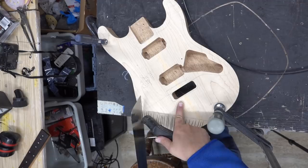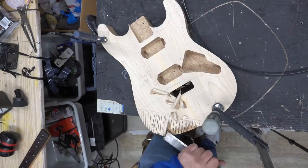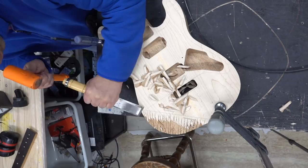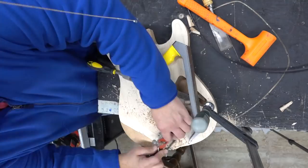We'll go ahead and chisel out each piece, dink it away, then come back with a file and file this stuff off, get it clean. I've got it right on my line, just right above my line, and when I start using these hand tools I'll get it perfect. I've got my chisels and spokeshave — cut this out by hand, get it nice and level.